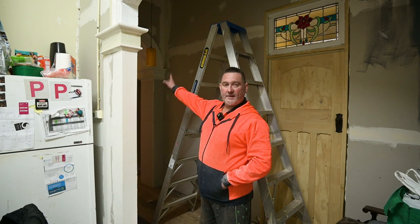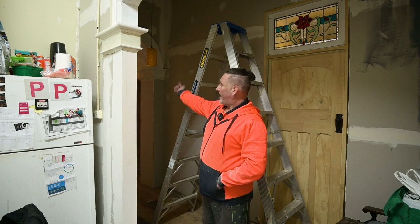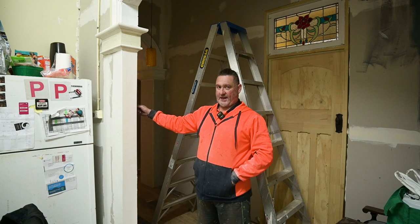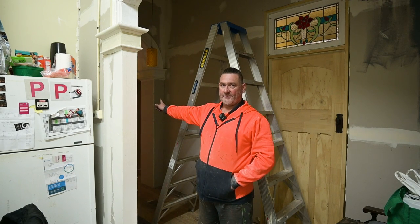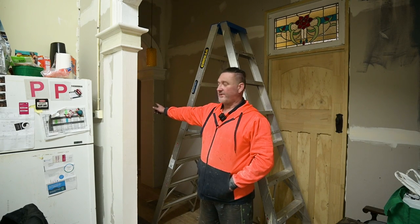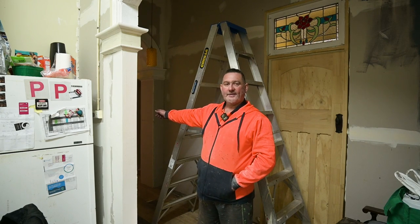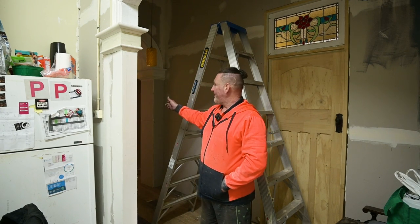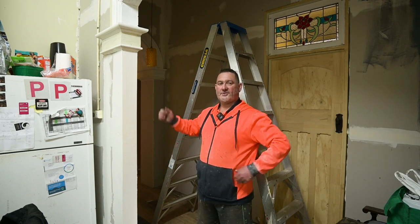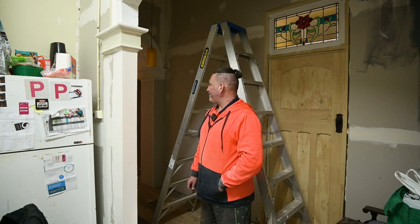And then down in the middle of this next bay, I've done the same thing, drilled a hole for where the light's going to go and up so I can bring that wire down. So they'll both be power cables. These will just be a switch cable, and I've got the switch cables at the other end. So the only downfall is I've got to work out which one is the switch cable that's connected to the roll of wire. I don't want to pull the other one up, so that's going to be a bit of a bugger, but I might tie that other one really tight, so when I go, oh, that's not moving, that's not the one I want, and I'll grab the other wire. So yeah, I'll get in and do that.